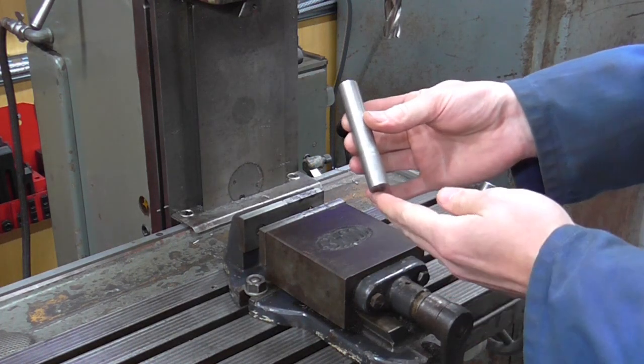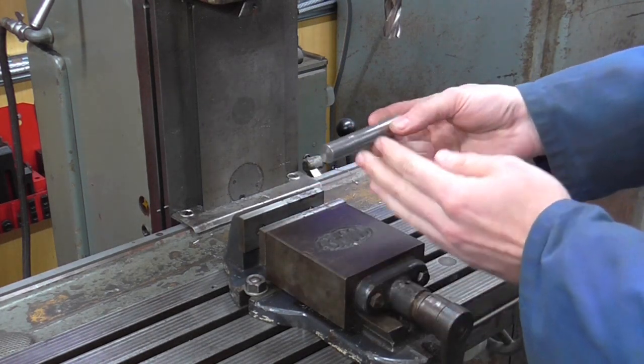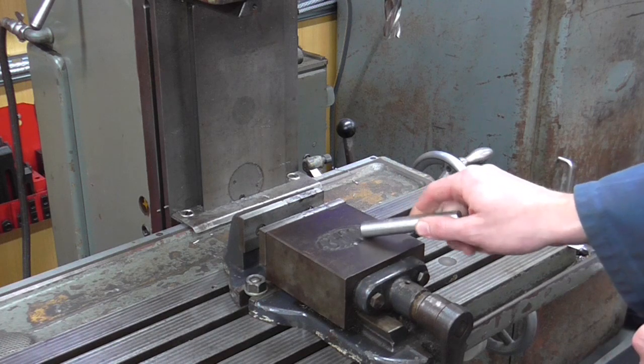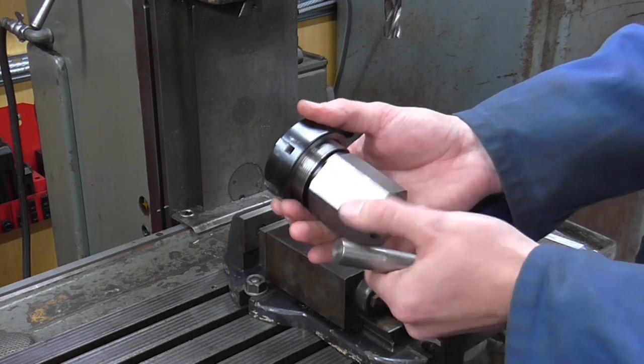I have here a piece of 5/8" stainless steel from which I'm going to make all of the nuts. Now typically in milling you would use a dividing head to produce a hexagon, but as you'll see I don't have a dividing head — I have a vice, a vice in fact that was given to me by Rich Ingley. I'm going to demonstrate another method I find slightly handier: using what's called a collet block.